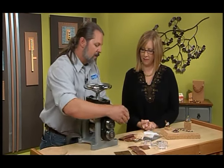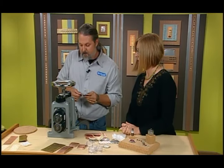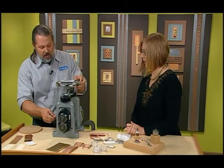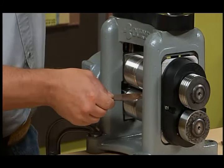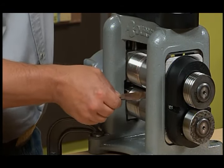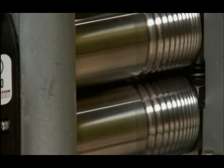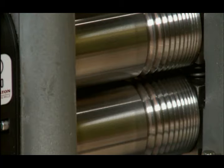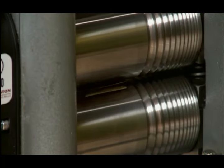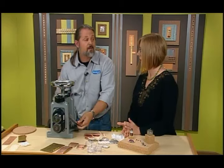I also have some etched brass — this is how I got the musical notes on the lid. I used acid etch to create the template, the brass piece. And then once that was done, I can use that brass because it's a harder metal to imprint on a softer metal. You'll be able to use it again and again as a template, maybe once or twice — brass usually tends to not last as long as steel. You can really make this custom by creating your own texture plates.